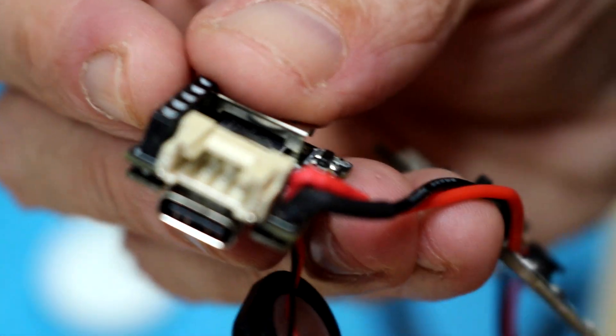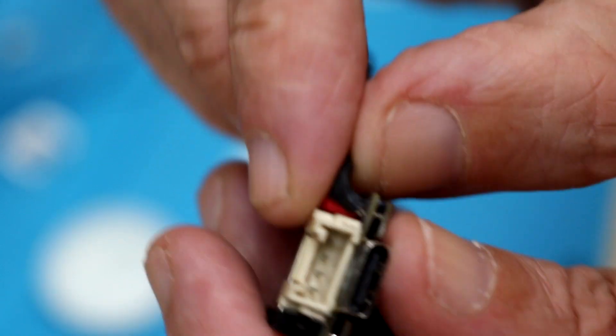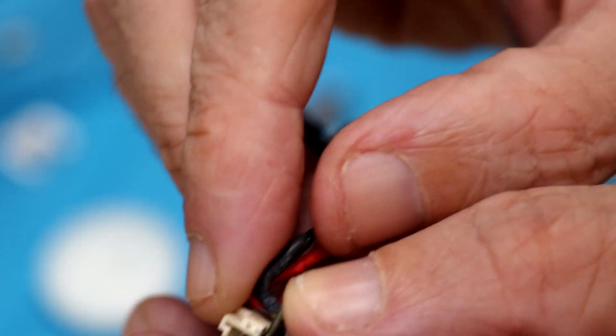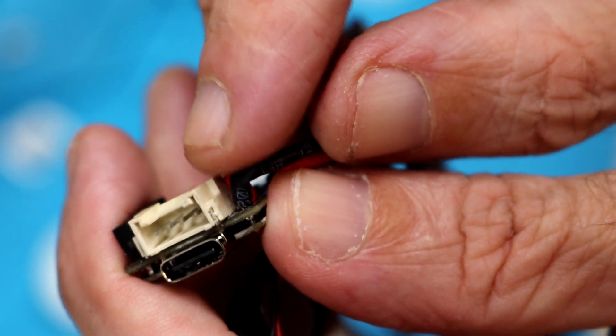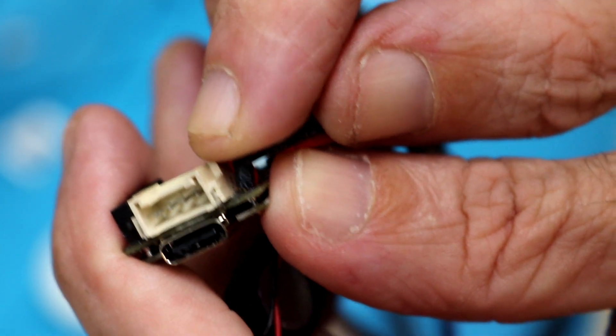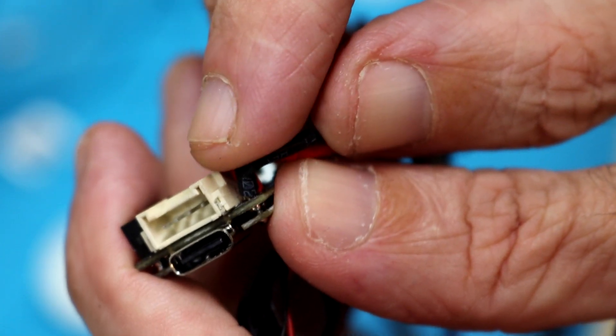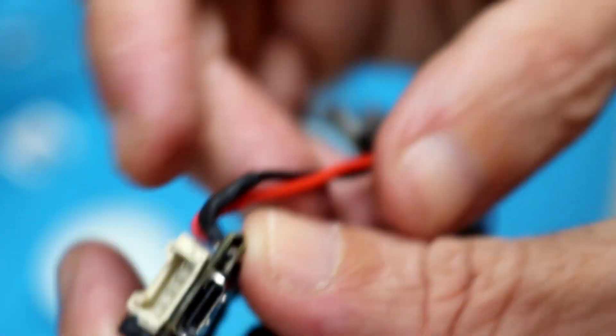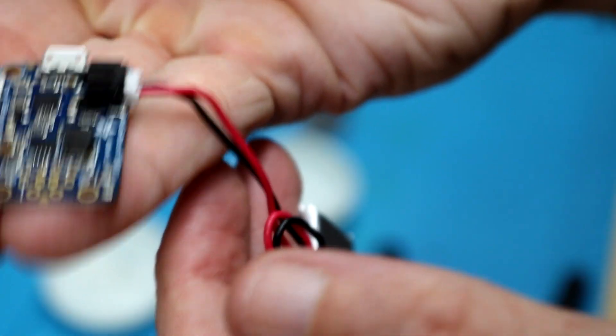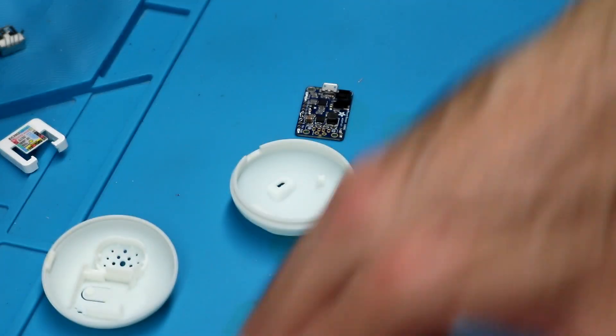You don't want to just bend the bases down because those tend to snap off, and you can still solder the board but it's going to be a real pain. What I did — and it's easier to do before heat shrink — is grab them with needle nose pliers and bend them down at a bit of a right angle, bending where the wire meets the top of the connector nice and sharp. That's harder to do with heat shrink on, plus pliers could pinch a hole through the heat shrink. So bend first, then put your heat shrink on, then solder to the board.